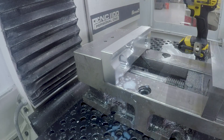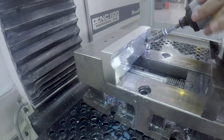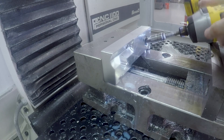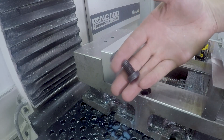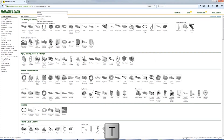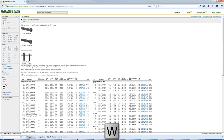Great note to remember when you do any sort of SoftJaw work: you do have to accommodate for the two screws that hold the SoftJaws into your vise body. In this case, you can see it's almost interfering. It is worth noting McMaster Carr and others sell low-profile screws that can really help if you're trying to work with some close tolerances or clearances.